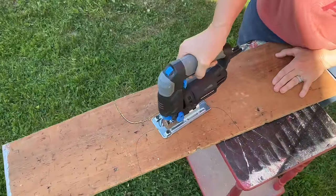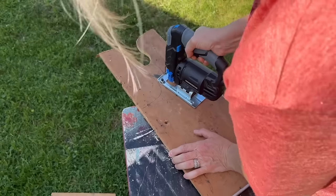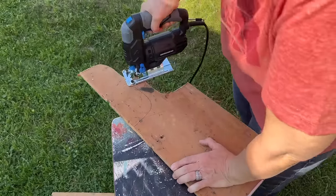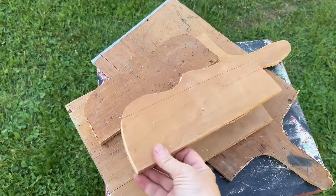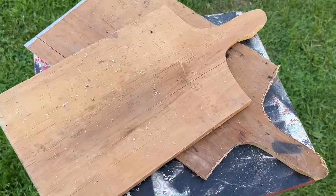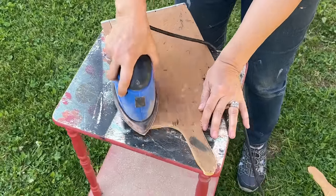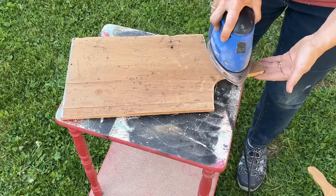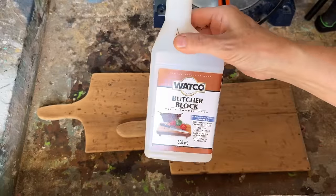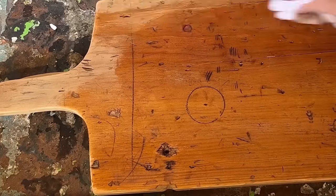You might be surprised at how affordable jigsaws can be. You can also find brand new ones really reasonably priced on Amazon — I'll provide that link down below in the description. Now that I've finished cutting them out, remember not to throw away those leftover pieces — we can use them for another DIY project later on. I'll stash them away for now. Next I'll take these breadboards outside and use some 80 grit sandpaper to give them a smooth, polished finish. These boards already have so much character so I don't want to sand them too much — I want to preserve that charming worn-out look. Most of these breadboards are primarily intended for decorative purposes. However, if you're working with brand new wood and you know its type, I encourage you to research how to make these boards food grade and suitable for use in the kitchen to ensure they meet the necessary standards and are safe for food preparation.